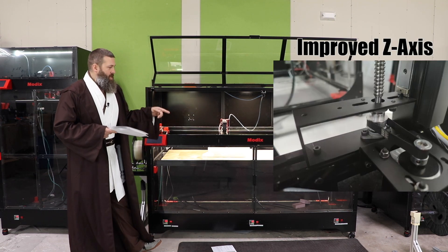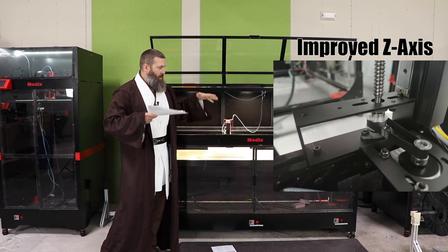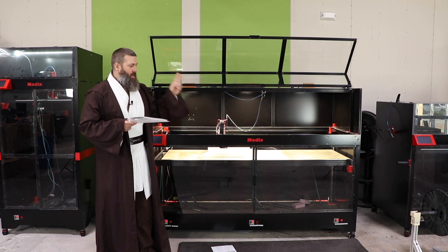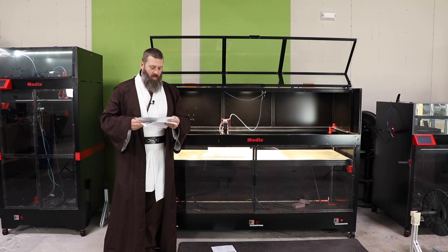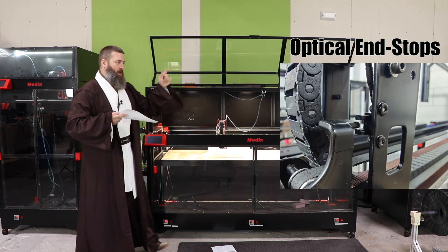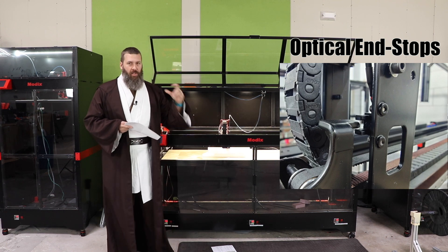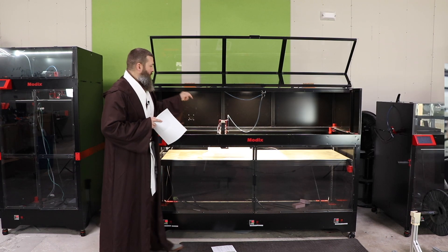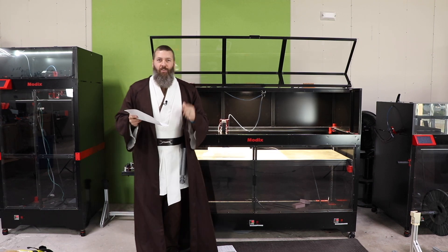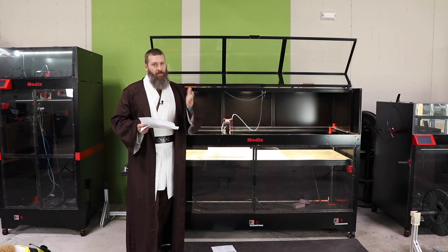The Z-axis has CNC machined brackets. So anybody who's experienced some drooping and issues associated with the Z-axis not staying in place or not being consistent — between the NEMA 23s and the CNC machined brackets for the Z-axis, I think you will no longer have any of those issues. Also, optical end stops. If you're going to go to IDEX and both tool heads need to switch back and forth and know exactly where their position is, you've got to have optical end stops. They're much better than the little clicky end stops that the V3 machines have. We're going to get optical end stops on all axes — on X and Y at least — and those will be far more precise and accurate than the current clicky end stops.